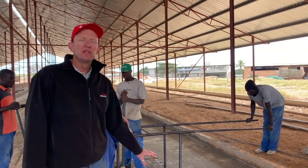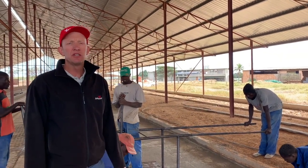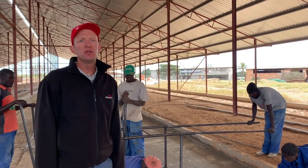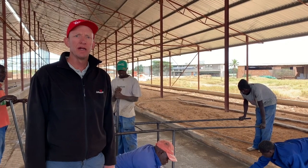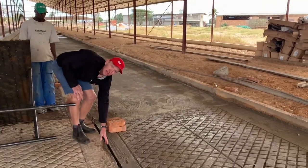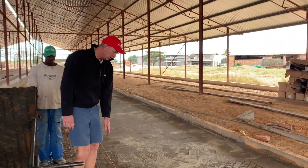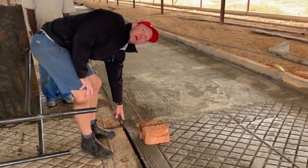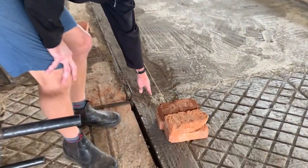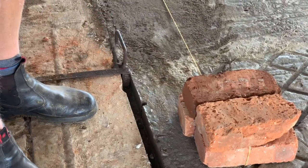One thing that we've found with practice is that we want to use 19mm stone and a fine river sand. If you use a very coarse river sand you don't get the nice straight edges and the nice grooves that we require. There you can see where we've made the groove — we needed to do a 20 by 20 groove for our cable. We put in this metal bar so when we cast we cast against that, then pull it out once the cement is dry.